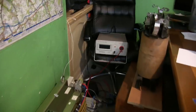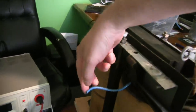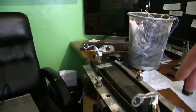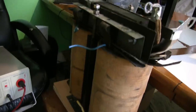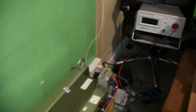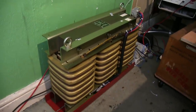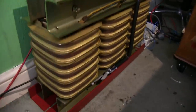This one's an 11kV pole pig, as you might know it. The 11kV went in here and the low voltage comes out each end — plus or minus 5% — normally submerged in oil. That's a project for a rainy day. Obviously I'm going to put 220–240V in and get 11,000 out. This one's a little bit more of a beast — it's 30kVA, weighs a quarter of a ton, literally. As you can see it's three-phase, and it's been converted so it now runs on single phase.